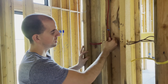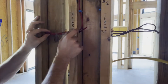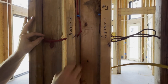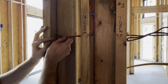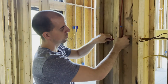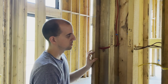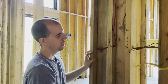Here's a neat little trick for the alarm wire: we've created a hole in this stud and looped the wire through. Now if I drill my hole through, I can pull the wire from here, or if I need to come over on the left side I can drill through and just pull this edge. So no matter which side of the stud I'm on later, we're covered — plus we've got good hardware here for secure mounting instead of just using drywall anchors. That's how you do an alarm panel and a thermostat.